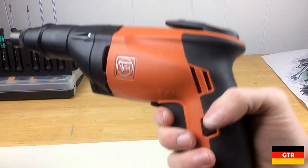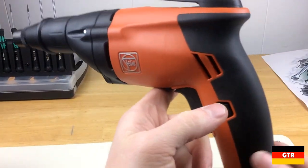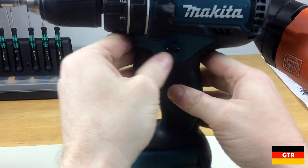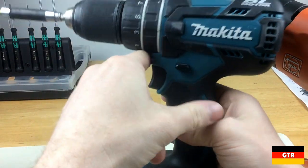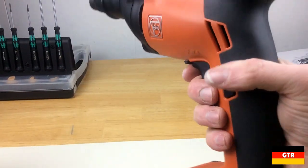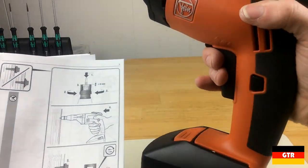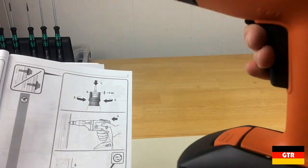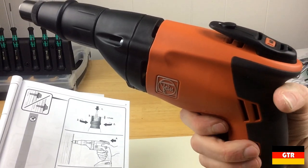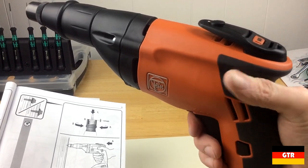After inserting the battery I noticed that the center of gravity for the tool is located in front of the trigger, which is not what I'm typically used to on a drill driver. Comparing it to a Makita driver, the center of gravity on that is approximately in the center of the handle behind the trigger. The Fein driver has a tendency to fall forward and rotate towards the ground. Consulting the manual, the diagram shows the driver being held with the thumbs well above the trigger — I think you'd need giant hands to hold it that way, and it feels rather awkward.